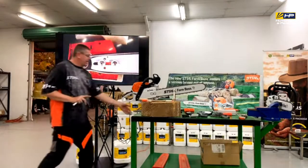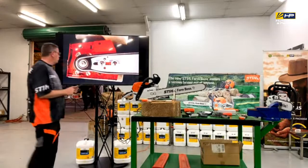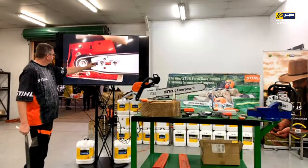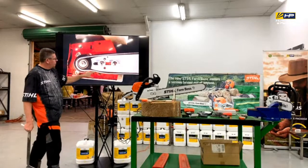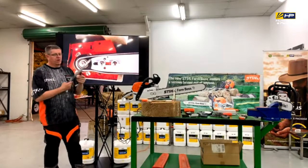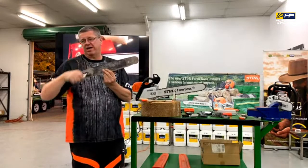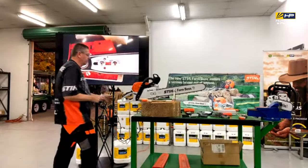So that example of that dip bar there, when you've got a loose chain, you've got all this power on the chainsaw itself, so it's driving the chain around, but as it's coming around, it's actually pulling it. So you can see where it's starting to move off away from the bar there, but then consequently what's happening is down this end, it's actually pulling into it, so it's actually pulling up, and it just keeps on chipping away at it, and we just end up with this dip in. So it's just a tension issue that needs to be addressed.